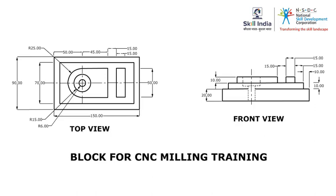Before you start the actual operation, there are some important preparations you need to make. Start by carefully examining the engineering drawing for raw material dimensions and critical tolerances. You must also plan the sequence of operation to ensure a minimal number of job-holding changes.